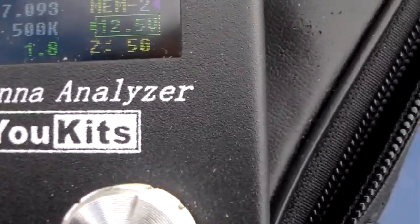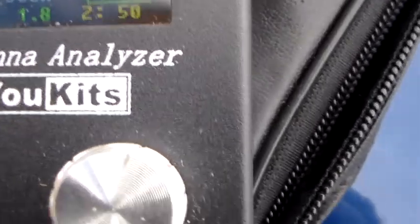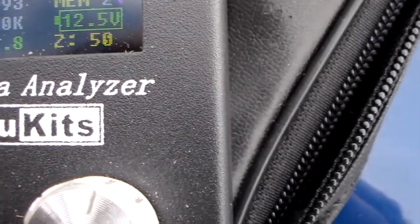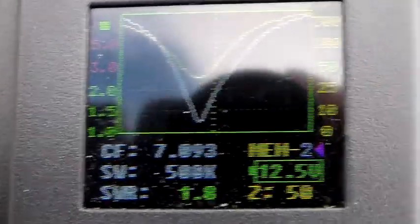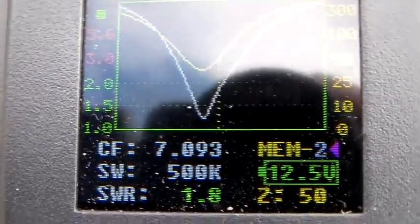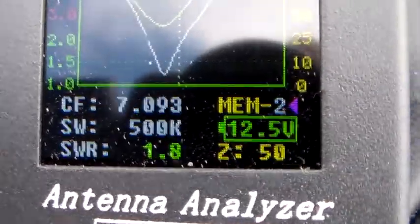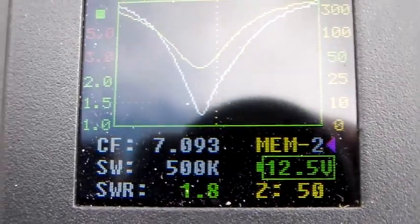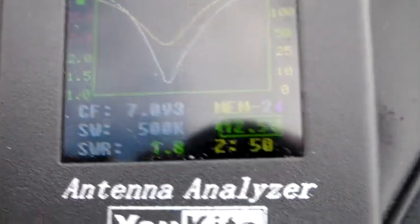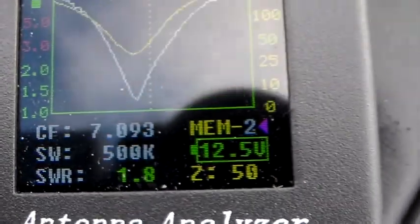I don't know if you can see that — that's interesting, I'm actually looking at the display. The lines are crossing. Because we're looking for the 50 ohm impedance, the minimum SWR will go to a lower impedance and it will go to a lower SWR. But I think being a solid state PA, solid state PAs are happier with the 50 ohm load. So what I've been doing is making sure that the match is closer to 50 ohms and not worrying too much about the SWR. Although obviously you don't really want the SWR to be much higher than it is here.